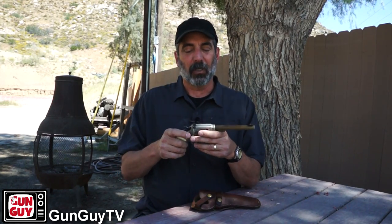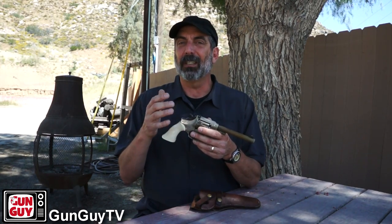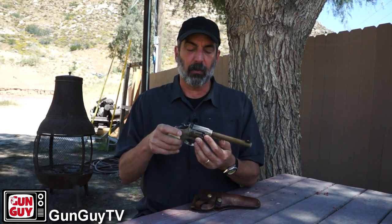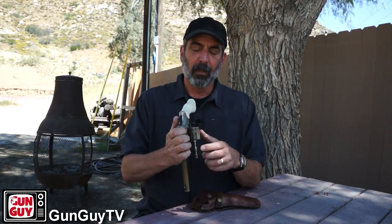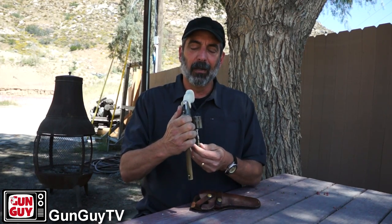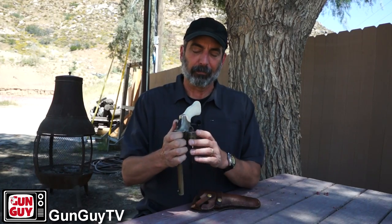Well, obviously people didn't like that very much, and sales weren't as good as they probably should have been, maybe. I don't know, but I do know that High Standard figured out that that wasn't a desirable configuration, and in the following models, the R102, I think, and this is an R103, and I think they went through R109, they all have the return spring that resets the ejector star and the ejector rod for you.